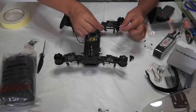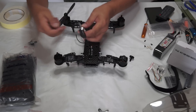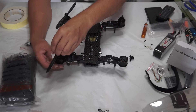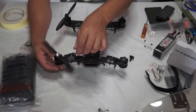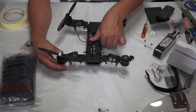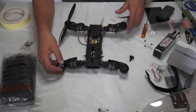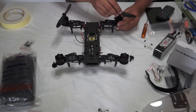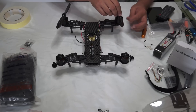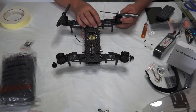When the motor spins clockwise, your propeller is tightening — you can see when the motor spins right the propeller tightens and spins with it. The next one is the counterclockwise propeller adapter — put them on. Pick up your clockwise propeller and check: when the motor spins this way, the propeller is tightening, and when spinning it blows air downwards. Let me check the other motor adapter — when the motor spins counterclockwise it tightens the propeller, and the propeller blows air downward.